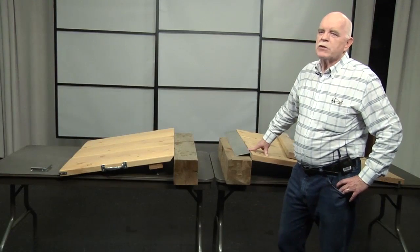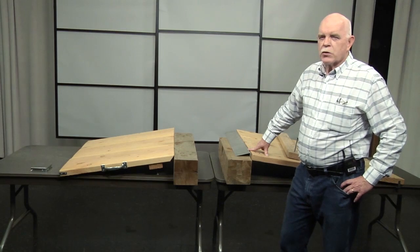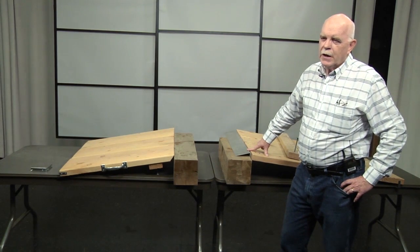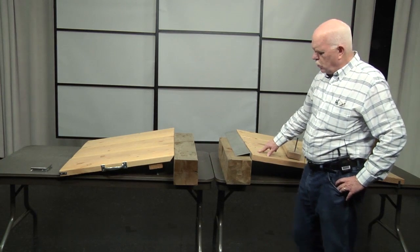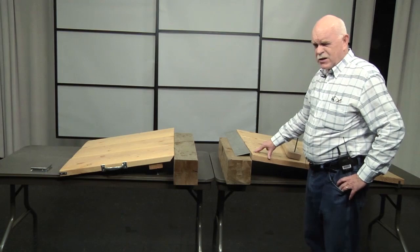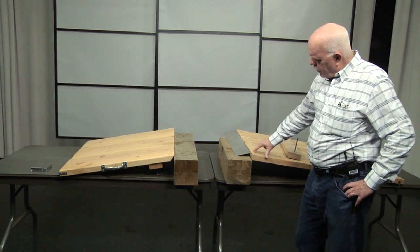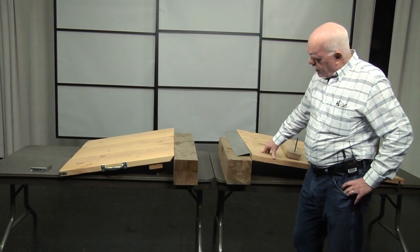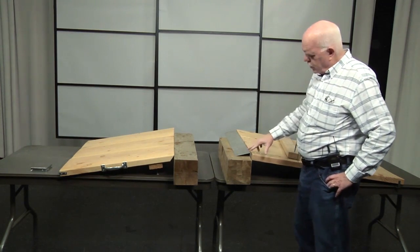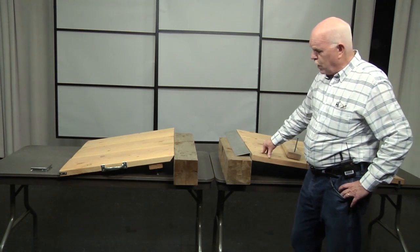I want to describe a situation when the ramp sits on a doorway threshold. When a screen door is present, the standard top cannot be used. Here we have a short doorway threshold that goes into about a 4 to 6 inch threshold height. So the ramp is very short, but with the standard top, you could notice a screen door could not open because the bracket would sit above the height of the threshold.